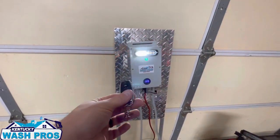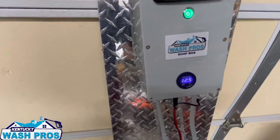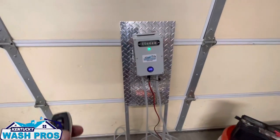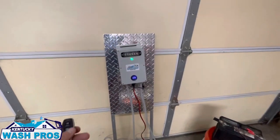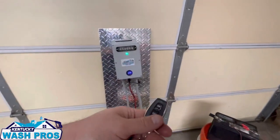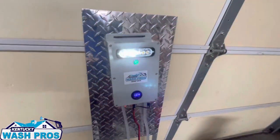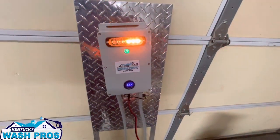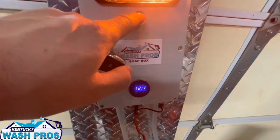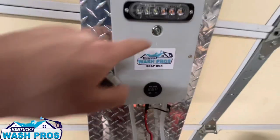When you're ready to rinse, just listen to this ball valve — it takes about three to five seconds to turn on and off. After it turns on, it takes three to five seconds to open. Allow about 15 seconds roughly for your soap to come through your line. What's really cool is if you forgot to turn it off, when you turn this off it automatically returns the shutoff. You can see it — it auto returns.